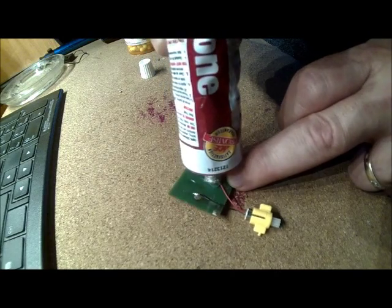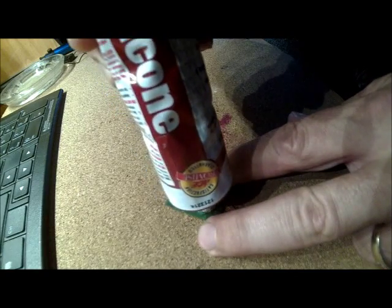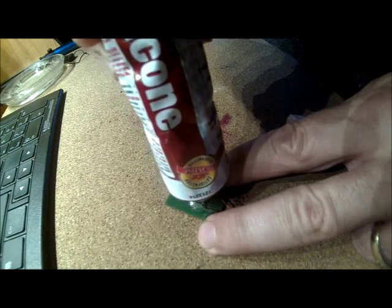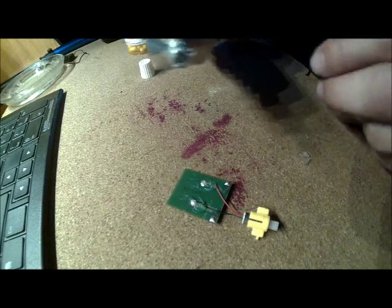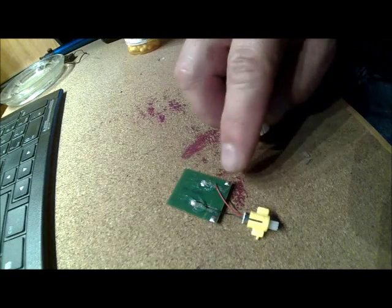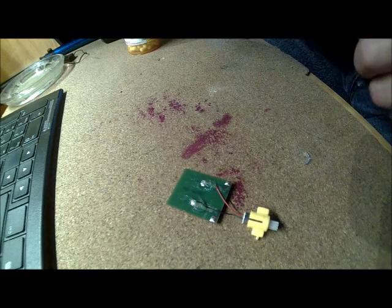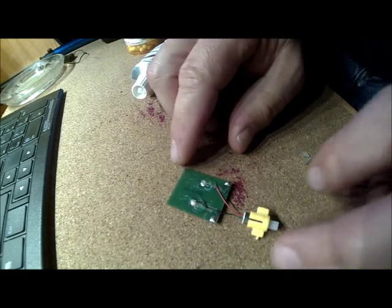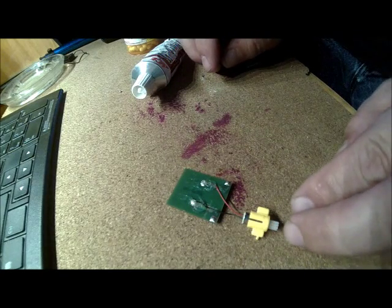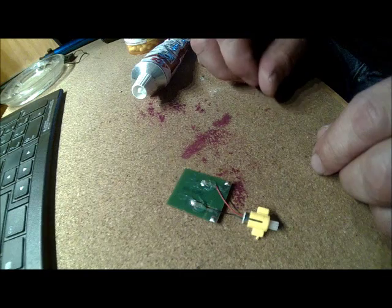Going up the line — the idea is to give the wire strength. Silicone is non-conductive, so even if these wires were touching each other it would not conduct electricity and current would not pass through it. What it's doing is ensuring that when this dries, the wire cannot pivot at the solder point, and it provides insulation around the wire. When it's dry it's ready to go into whatever mechanism it's going into — in this case a little tiny fan that I might put in a box and make my own little desktop fan.